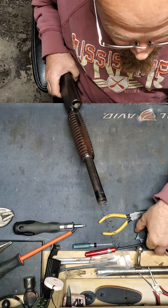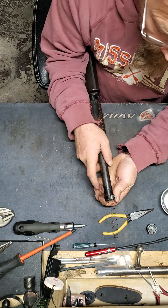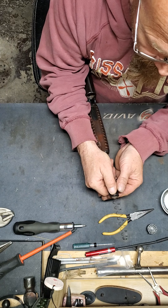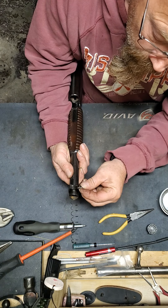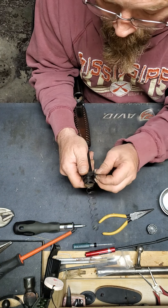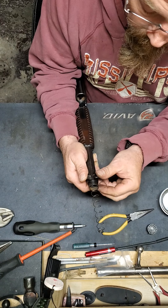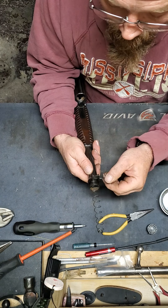Open the action up. Next is the barrel band — or the magazine band — that slides on here. There's a groove here that I'm aiming for. Slide the barrel band on until that groove is about centered. The reason that groove needs to be centered is because this screw runs through it and it's got to hit that groove perfectly.